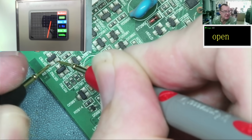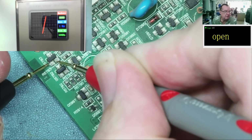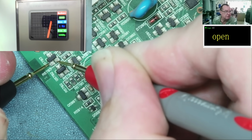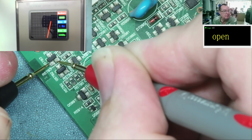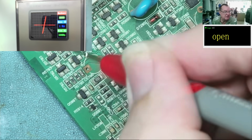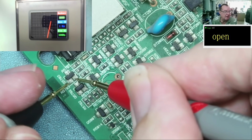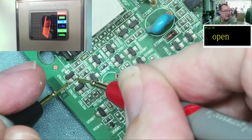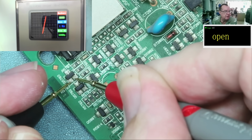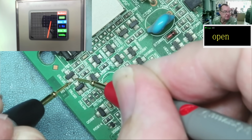But we can say the device reacts to a voltage on here related to ground, okay? So it's actually some sort of switch. I suspect this is a MOSFET. It looks like a MOSFET to the multimeter. And I think the way that's behaving in that respect is due to components around it. But we can say it reacts, yeah? So some sort of switching device.